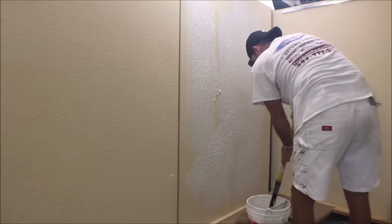I've matched this texture before in condominium lobbies and people's houses. I'll leave links to other skim coating videos in the description below — from skim coating over a popcorn ceiling, after wallpaper removal, how to seal the brown paper that gets torn from wallpaper removal, so be sure to check those out. I'm putting most of the pressure on this side so it's not leaving a line on the left side — otherwise you'd see exactly where the roller's been and where it hasn't been by the lines. There's the roller texture.